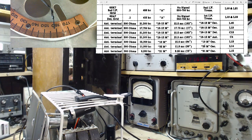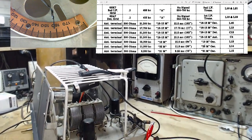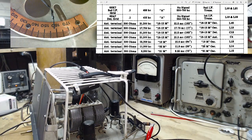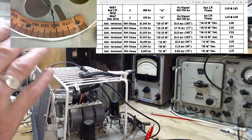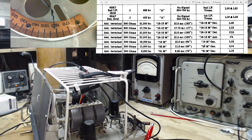since each end is affecting the other, the C46 and the L12, there's probably a number of combinations that kind of work in a way, but cause nonlinearities in the way the radio tunes, probably. So I've probably done a fairly smart thing by putting one of them into a neutral or middle position here. This one, it's still up fairly high. Well, maybe now it's a question of going back and forth, and stretching this thing into its proper place.